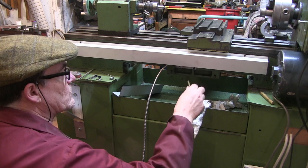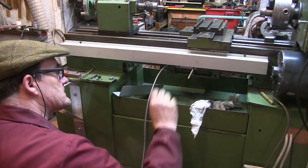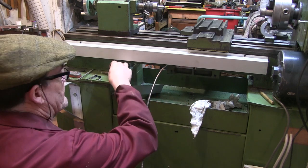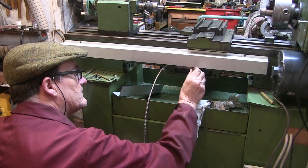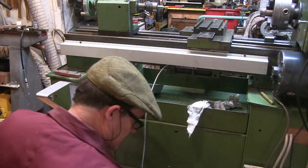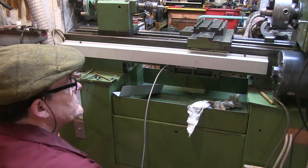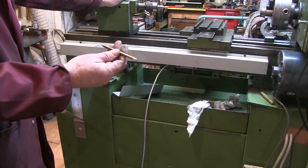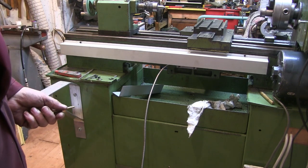The trouble is these are 5mm holes and I haven't got any 5mm threaded bar anyway, and the longest 5mm nuts I've got just don't clear this. So I've got to make some. Can't go out and buy some because we're all on lockdown at the moment and Screwfix and everywhere is shut anyway. So I've made this bit from some 6mm brass - I've just threaded the ends.